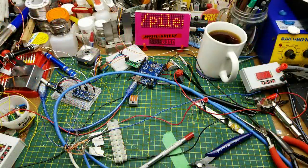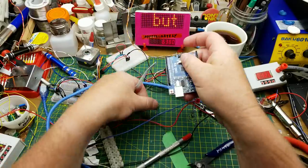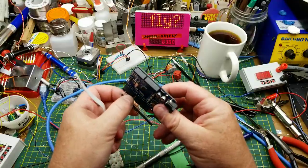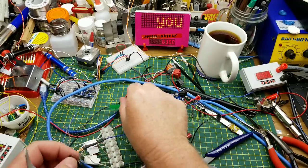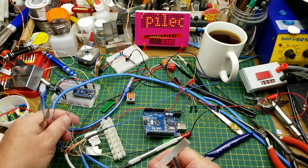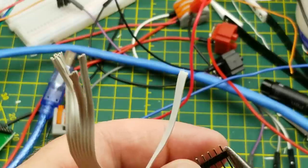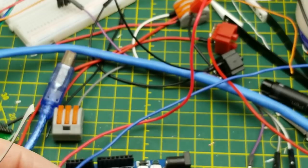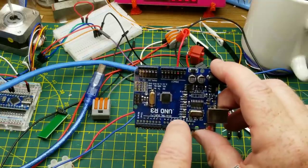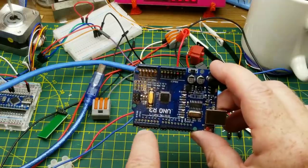I think I'll use header pins to break out all of the stepper direction and pulse signals to the Arduino. I can't put them all in one shot because the Uno has this weird little gap, so I'll have to use two chunks of pins. I'll use ribbon cable to go from that over to these, giving me a bit of distance and flexibility. Six pins on one side and two pins on the other gives me eight pins for four stepper motors. The reason I'm not putting them all on the first eight pins is that pins 0 and 1 are TX and RX, and putting stuff on there can sometimes interfere with serial communication when you're trying to upload software, so I tend to avoid those.